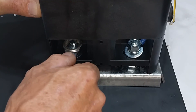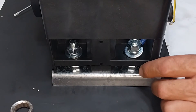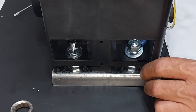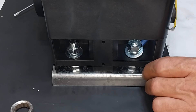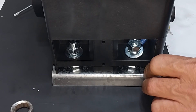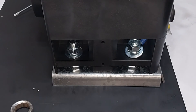If the gate motor is not 100% aligned with the steel sliding gate, one can still adjust the gate motor in order for it to be parallel to the steel sliding gate. One can also still move the gate motor forward and backwards in order not to cause an obstruction onto the steel sliding gate.